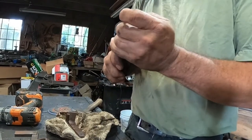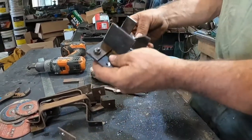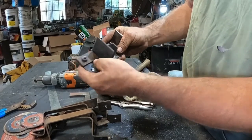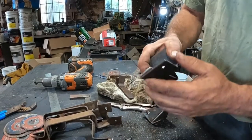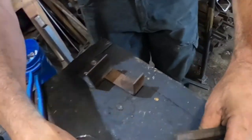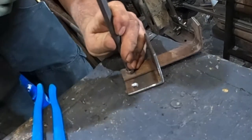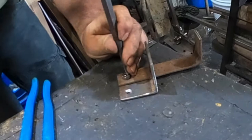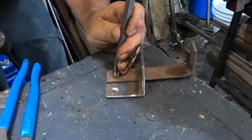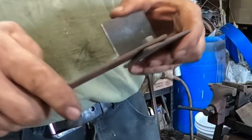What I'm going to do is cut that off so we won't lock that nut in place. Take the center punch right where the bolt and nut meet — we want to punch it, and I usually do it three times. That will lock that nut so it won't come loose.